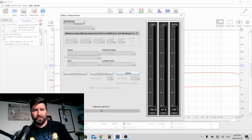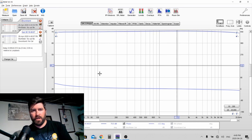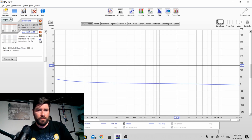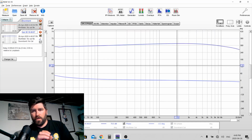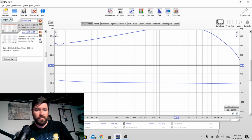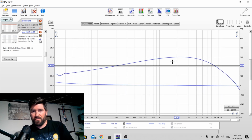And there we go. As I can see right there, we've got more gain on the analog device than the sound card itself. But that's okay. Let's zoom in a little bit on the vertical, just so we have a good representation. Because if you don't have a vertical scale that is precise enough, everything's going to look real nice and flat. So let's boost that a bit. This is by half a dB increment, so it looks a bit weird, but we're basically flat.